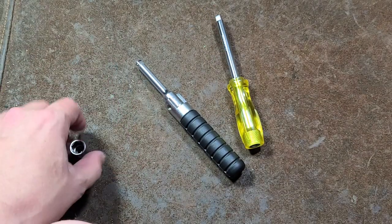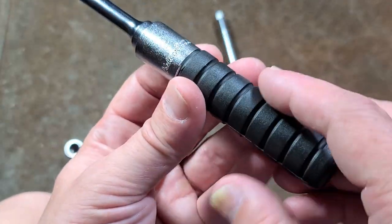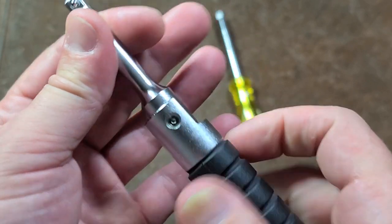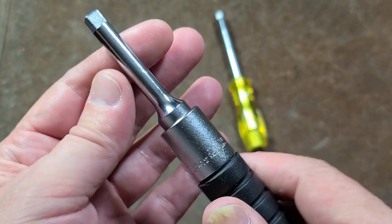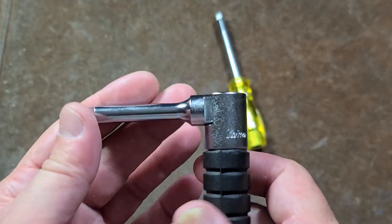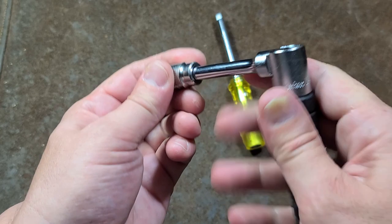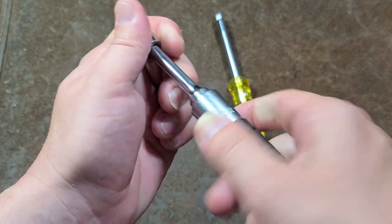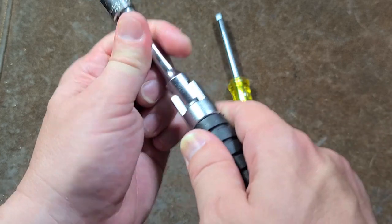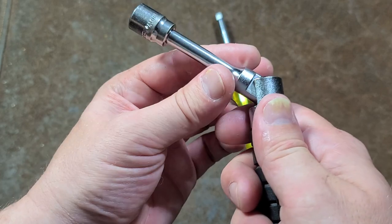The other tool I saw was pretty surprising - a big chunk of billet steel with pretty nice tolerances. The idea behind it is you pull it out; it's kind of like a breaker bar but you get a longer extension. You pull it out to break your fastener, push it in, and then spin it out like a quarter-inch drive spinner handle. It also lets you turn things at angles like most breaker bars.